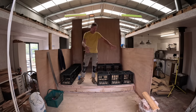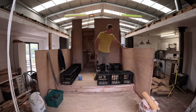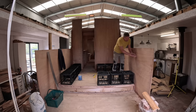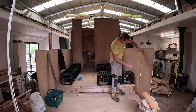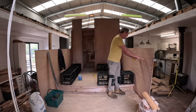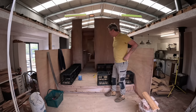and from here back is that model that I showed you yesterday of where the outboards, the gas bottles, fuel tanks, and a little generator go, all under that area there. These sides will end up at about that height, and then step down a little bit going to the aft deck. A meter from the bottom of the boat, so the aft deck ends up at that height there. So that height there will be the aft deck. And of course, these sides will stick up a little bit here to give us an edge around this outdoor area. So that should function really well.